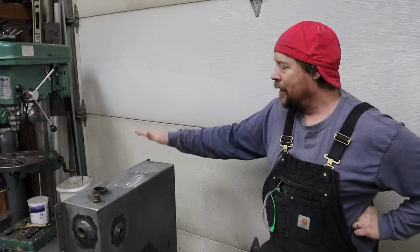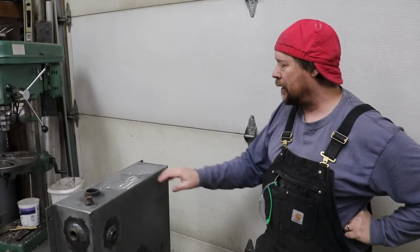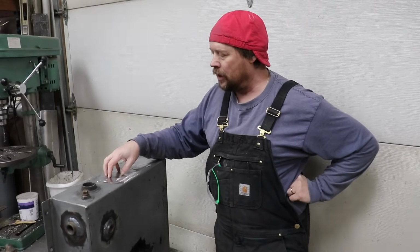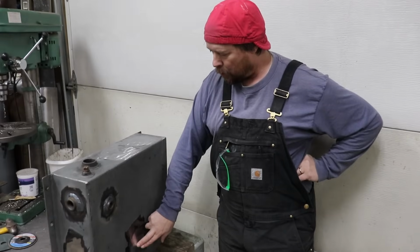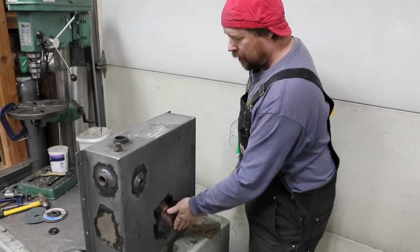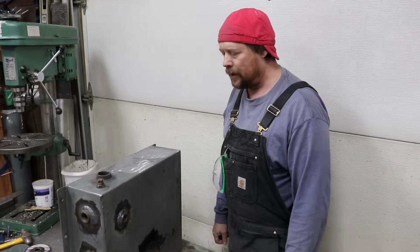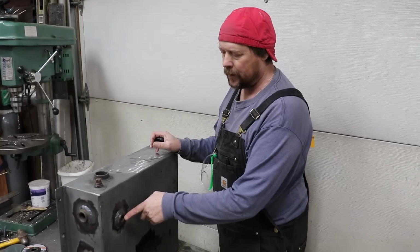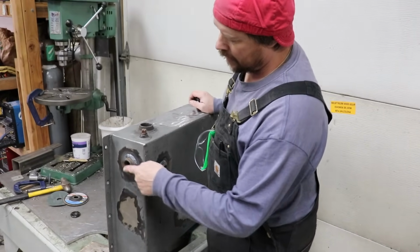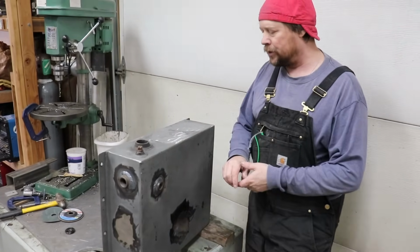Okay guys, I just finished touching up these welds. We ground this all off and blended it out. Turned out real good. There were two ports right here, a port down here, and also one here. So those are all filled, welded out, blended out. We added a port right here for a sight glass, and we also relocated the return line up higher, and it's got a drop tube on it now. So that turned out real good. Super happy with the results.